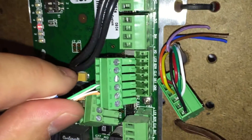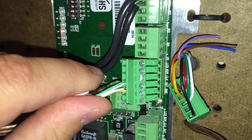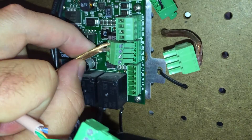Because when I put them onto the 51E, you got to put them in like so. The positive is going into data, the negative going into clock. You also want to use the auxiliary power.